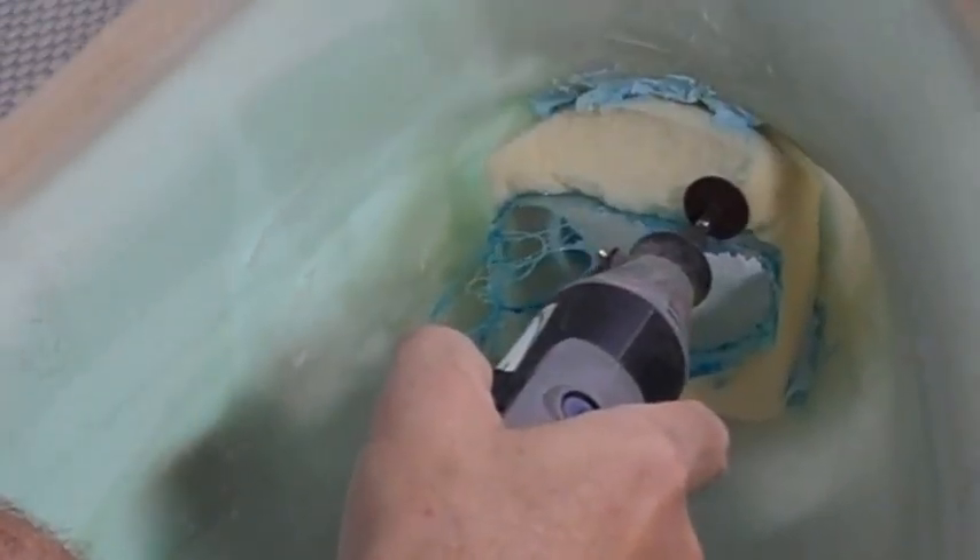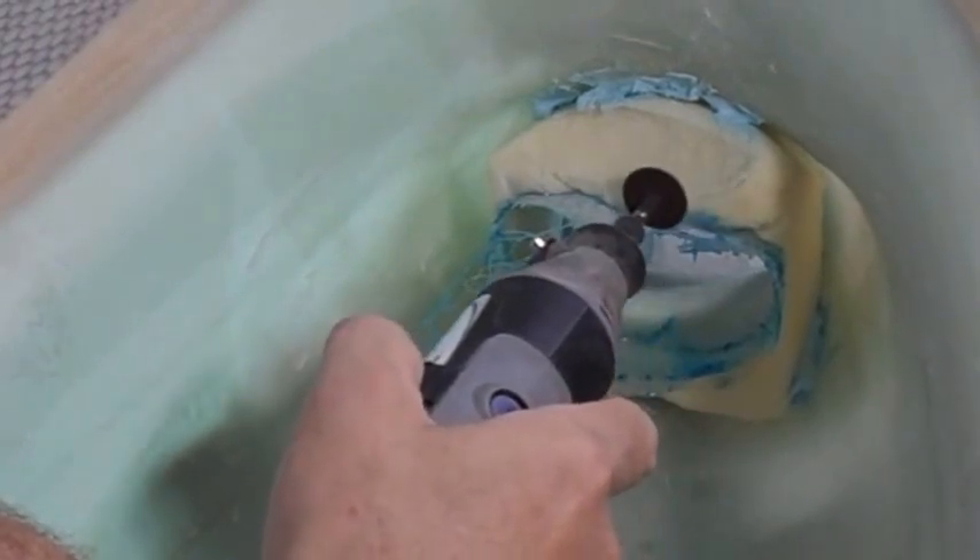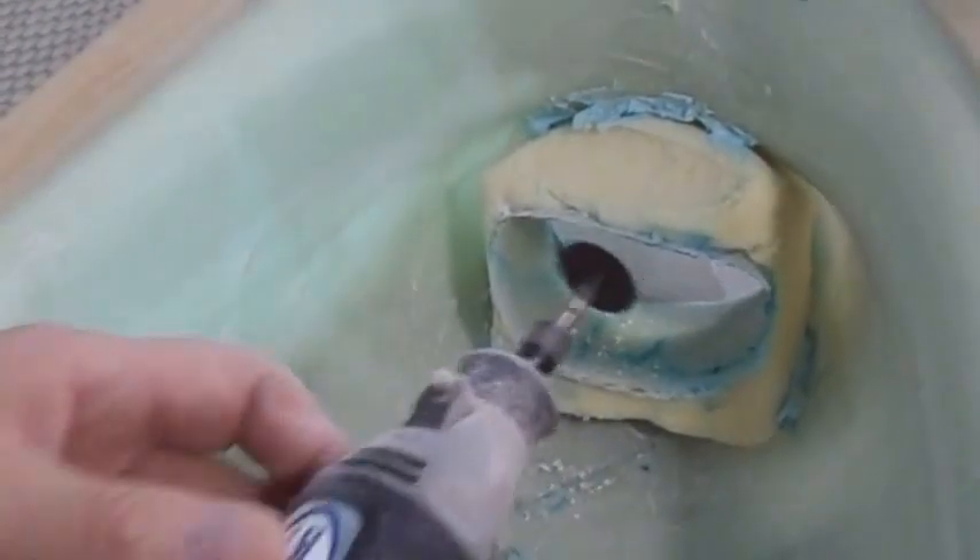I'm pretty sure it'll hold this way. I have a lot of sanding and shaping to do, and then when I'm done with this layer, I'll put some epoxy in and then put some peel ply in. I did try to put some peel ply in there and it didn't work out that well — this was actually my second attempt; the first layup I just pulled out because it was going pretty badly. I love the smell of burning epoxy in the morning. Then we just fill in the weave a little bit all around so that we can sand it afterwards and make a nice transition.